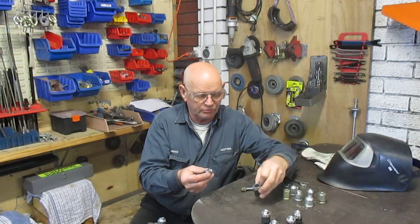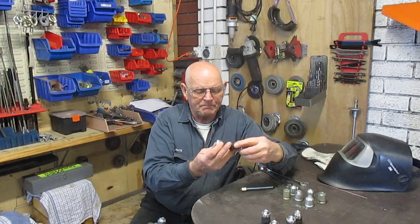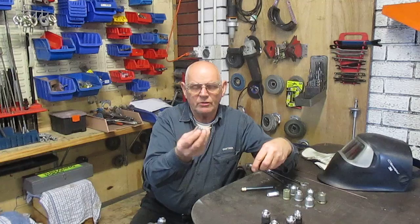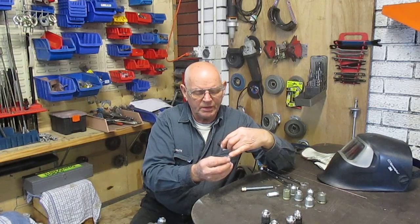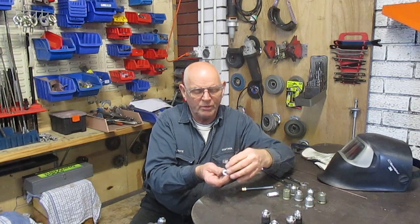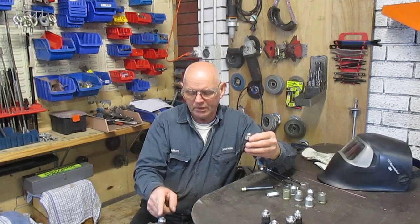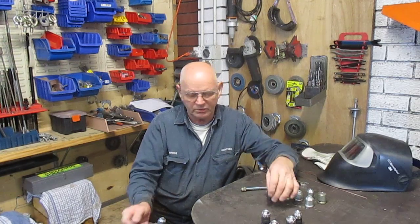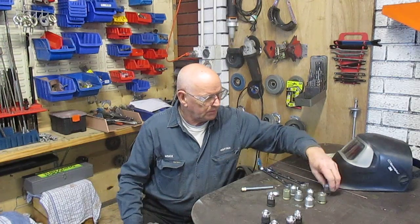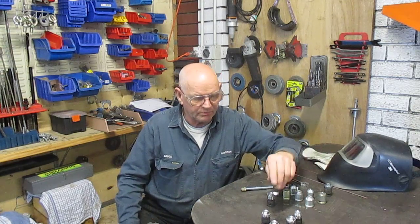So: find the socket, cut the long nut off in the lathe, countersink it a little bit so it'll mate onto the ball, drop the ball in, drop the nut in, and lock it up. I have one here in the device at the moment which I'm ticking up — you can see it's a bit hot and rough, but I'll be back into practice once I finish these.